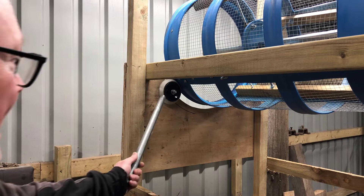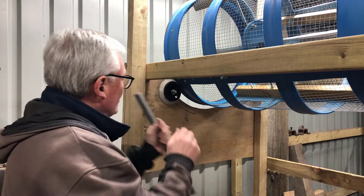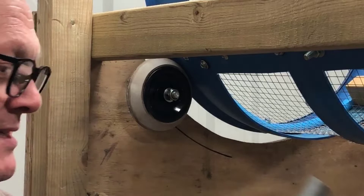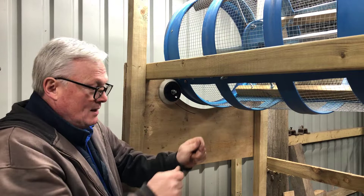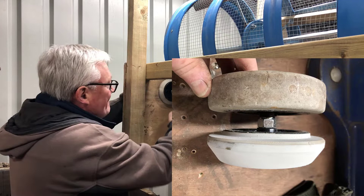You'll see there one of the rubberized wheels that I've filed down - and in part one of this build you can see how I filed it down. It's a solid rubber wheel. I put a big nut and bolt through it, put it in the chuck of my pedestal drill, and as it's spinning around I filed it to the right shape so that wheel fits into the grooved V-shaped lip at the top of the barrel.